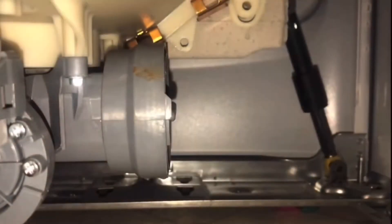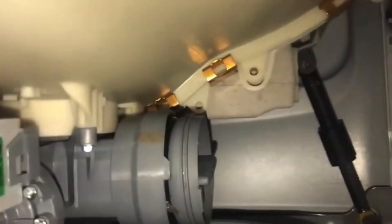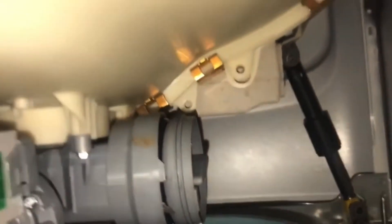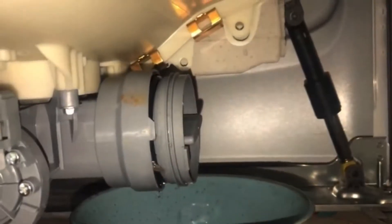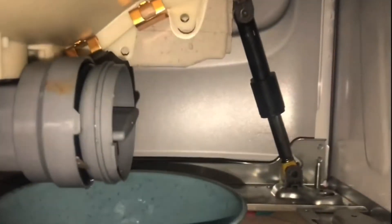This is the trap right here. I'm going to put my hand in from the right-hand side and turn it about two and a half turns counterclockwise. It's hard to get the camera and my hand in there, but here's what it looks like when it comes out. As I'm unscrewing it, water is going to come out, so I'll let some water out, then screw it back in, dump that bowl into a larger bucket, and repeat until no more water comes out.